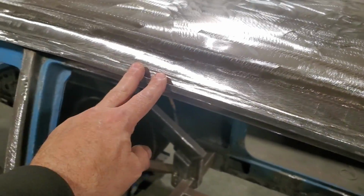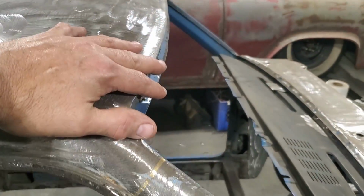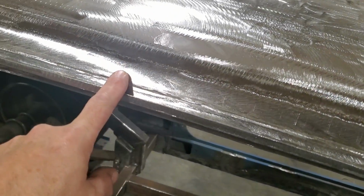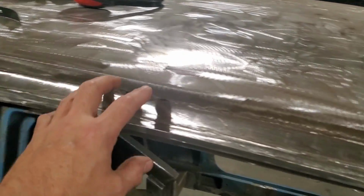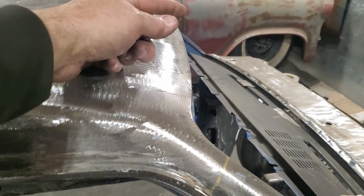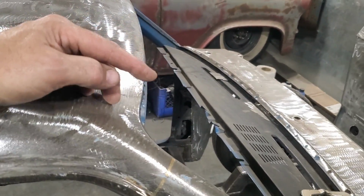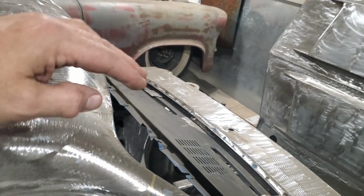The same process works for the front of a pickup truck up here in front with the curvatures. If you noticed, this piece here was the first piece I made. I never cut nothing out of the roof itself. I made this piece first. It's the last piece I'm putting on, okay? It would be the same way if you were doing a Ford truck along the front of the roof there. I'd make the outer section first. It's a bit more tricky because you got to make the curvature on the front and the little lip on the bottom, so you'd make that in 2 pieces.